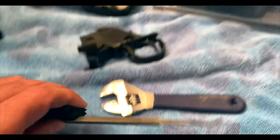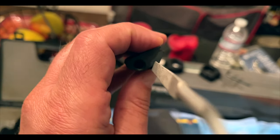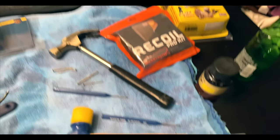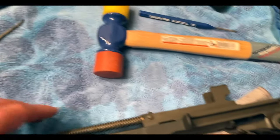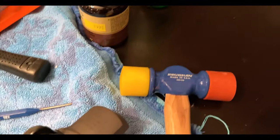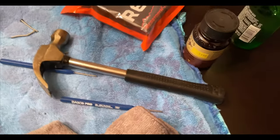I'm going to use this triangular file. What's great is when you put this on, it fits perfectly snug, so you can get in there. You do not want to go heavier on one side more than the other. A triangular file is really really important. I'm just going to take off maybe a tenth of a millimeter and then try to softly hammer it in — you don't want it too snug but it's not going in right now. About a quarter millimeter should do.